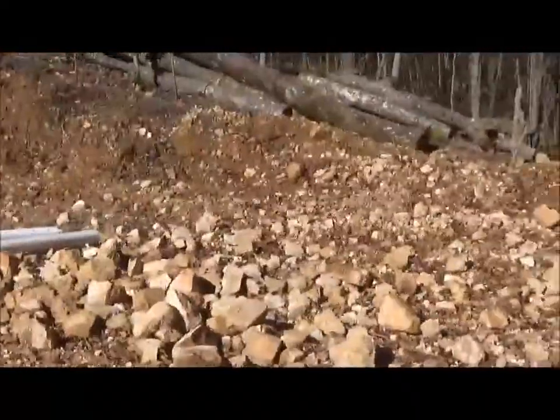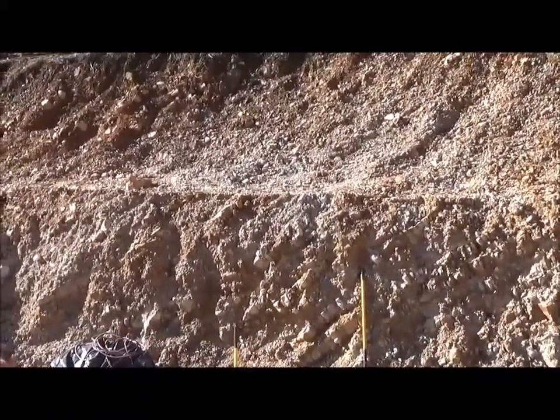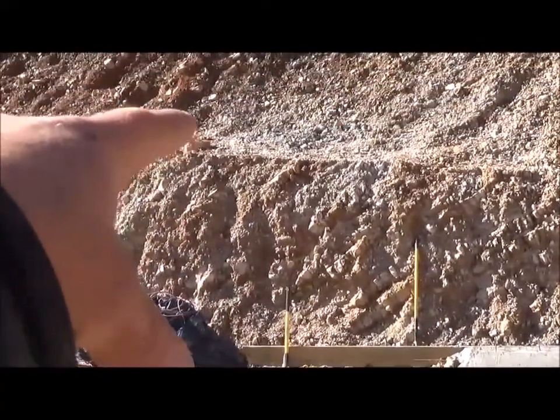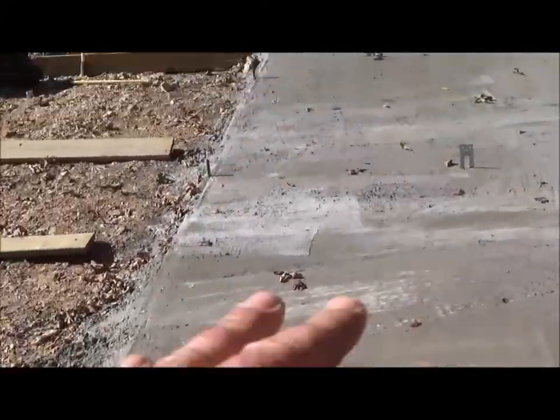So on these two, extended out another 10 feet. So some 2 inches in there. I'm thinking what I'm going to do with these rocks is, this would be 7 foot of block. I haven't measured it, but it looks like it might be barely a foot above it, and then 4 feet above it. So I think I could probably scrounge up enough rocks to go over these cinder blocks where they're above grade. Once it's backfilled, I might go over the cinder blocks, mortaring on the rocks, give it a natural look. And it'll be good extra thermal mass protection.